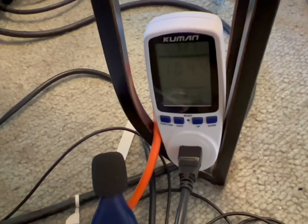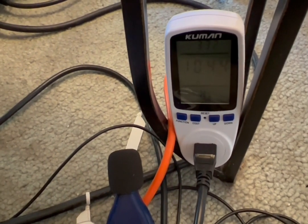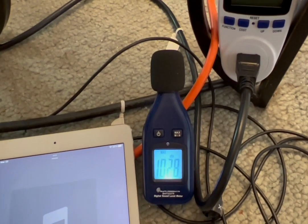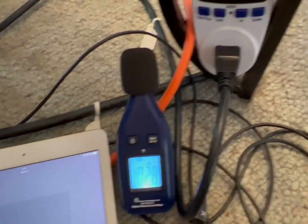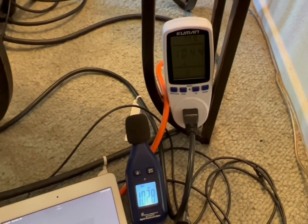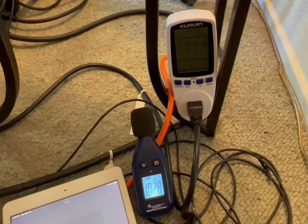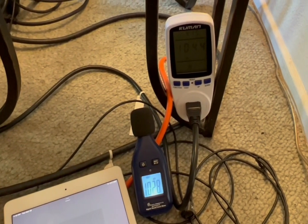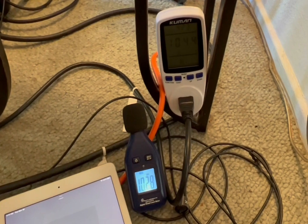So why did I make this video? I wanted to know: do I need to go out and spend a thousand dollars or more for an 800 watt unit to run the system properly? The answer is definitely no. I can see this system can run safely on a 400 watt system. Maybe if you want to be generous, go up to 500 watts, but you really do not need a thousand watts. Now, people say they're using a thousand watts for a system like this because they're DJing and need it for hours at high volumes. The louder you play and the higher the dBs, the less time you're going to run the system. But I have a feeling that even at max volume, my 400 watt unit will run two or more hours. I'm not a DJ so I won't be doing extended time testing — all I can do is estimate.